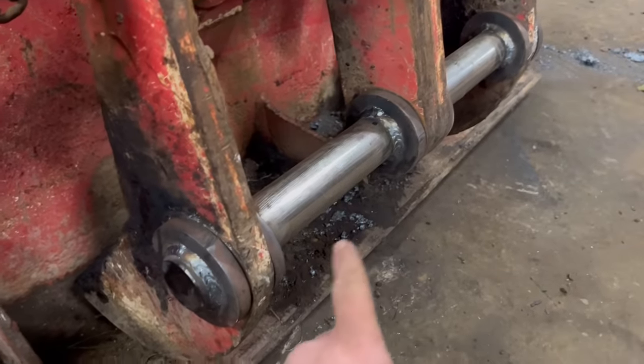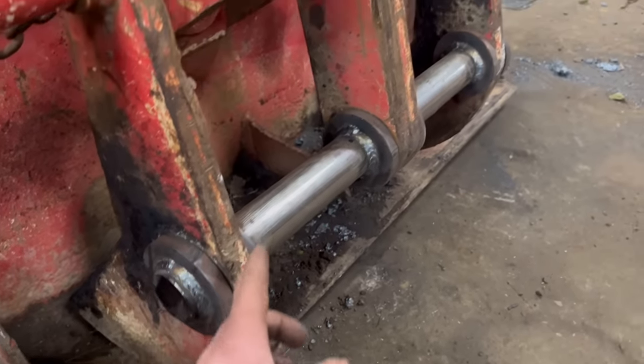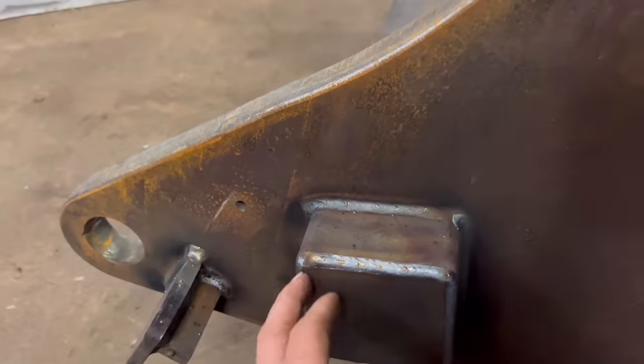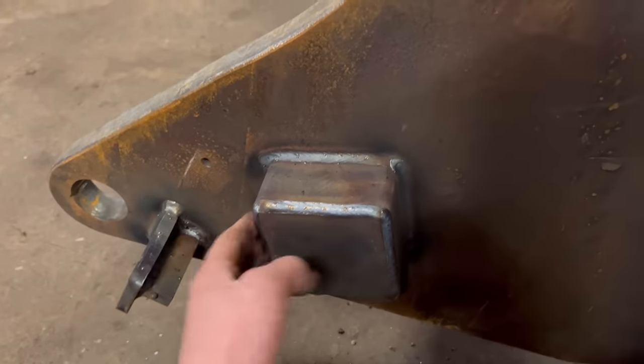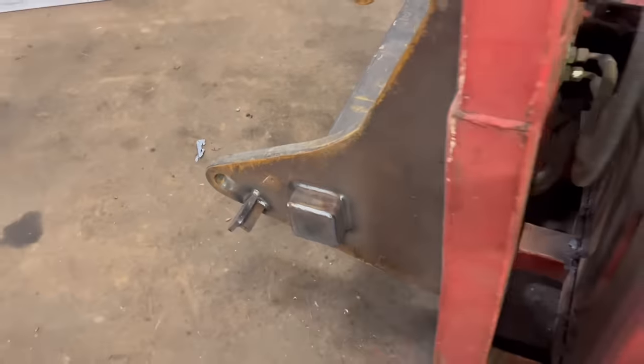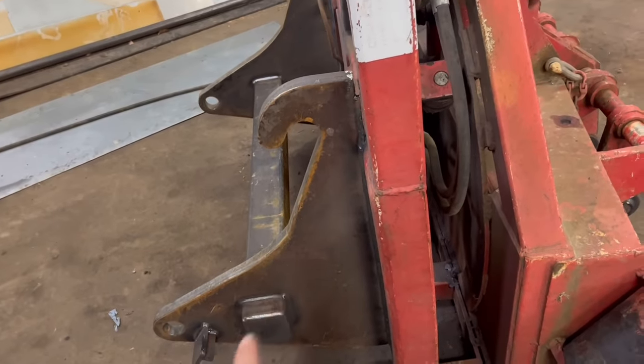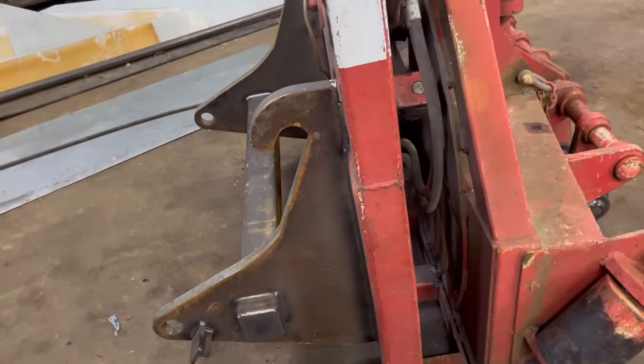So that's that shaft welded in now, got them washers welded on. I have also cut out some end plates for these box sections. I welded them round as well, so that's all sealed up now. So what I think I'll do now is just try it on the machine, make sure my stops are right, and if it fits, then I'll chuck some red oxide at it.